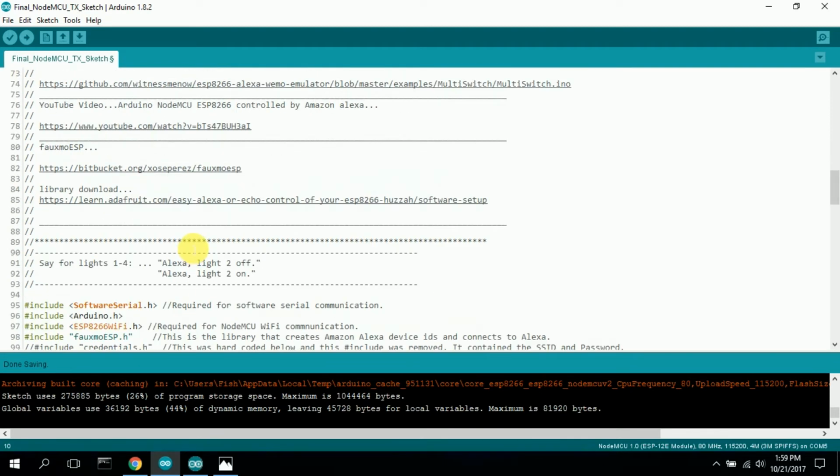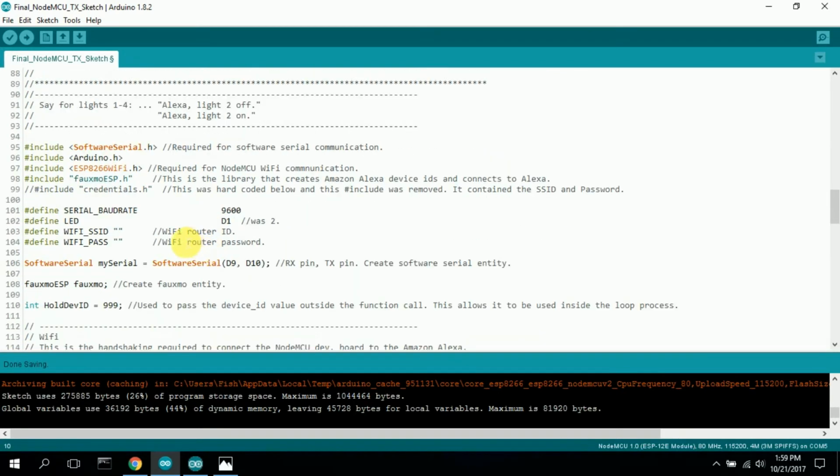You download it on your phone, you generate a key, and then you put that key into your program, and that allows it to communicate, in this case with the NodeMCU, because the Wi-Fi on the Arduino does not connect and hold a connection very well. In fact, doesn't really do it too much at all.